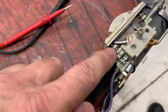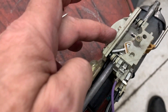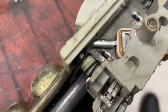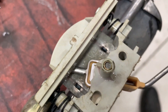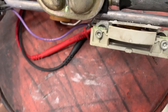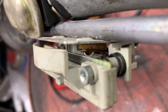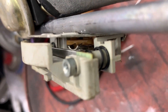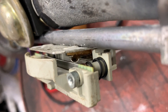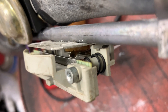I got this one down to seven, and I did it by loosening these screws, which changes the position of the resistor element in here versus the wiper arm right there. Flip this over and you can sort of see — there, yeah, you can see. There is a coil which is the edge of the resistor, and you can see how the wiper — the little curved part — is sitting on the edge of the wire-wound resistor.